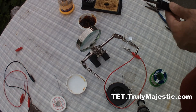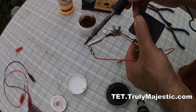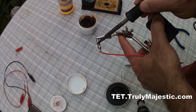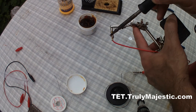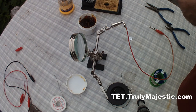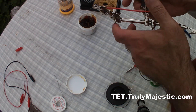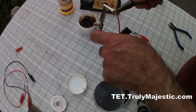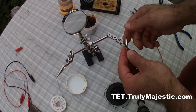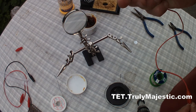Thank you very much for this session. As you can see the solder is nice and smooth — that's not a cold solder. A cold solder is when there's air inside; it looks like it's soldered and connected but inside it's basically not joined properly, and you might have intermittent disconnections and problems in your circuit. But that's it for this particular clip — I'll see you again in another video.